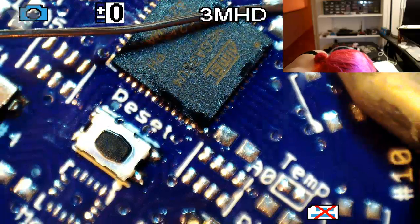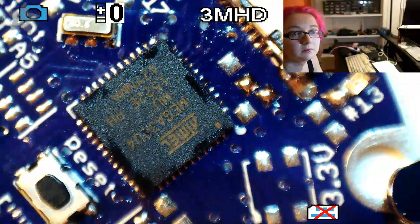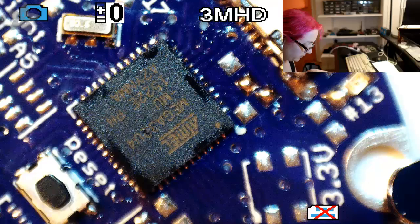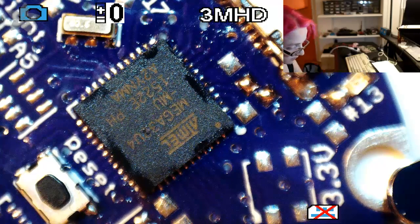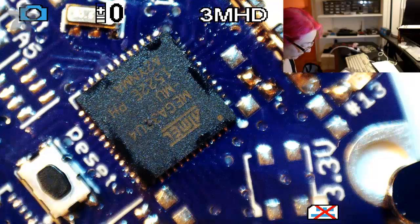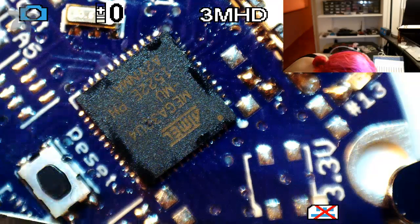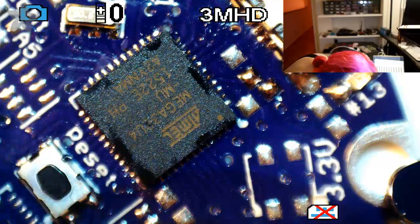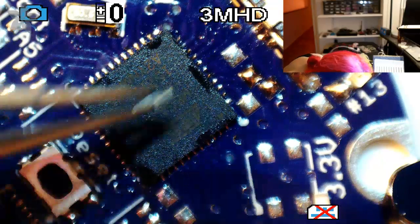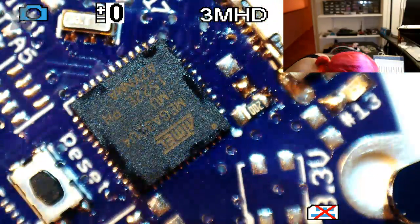These are the USB serial inline resistors. The resistor book. I'm going to pull out about 22 ohms, not precision parts. I got 20 ohms, which is plenty. I don't even know exactly why these aren't built into the devices. I just noticed that some USB devices you need to add about 27 ohm series resistors, and then some you don't. I don't know if it's the ones that you don't have to, they're built in or not. Okay, so got 20 ohm. Normally I don't work with those 603, but in this case I really wanted to make this design small.